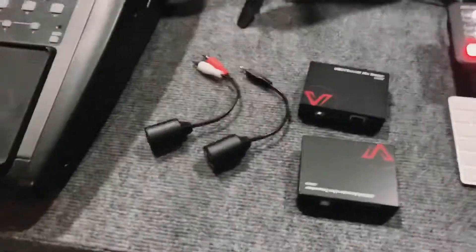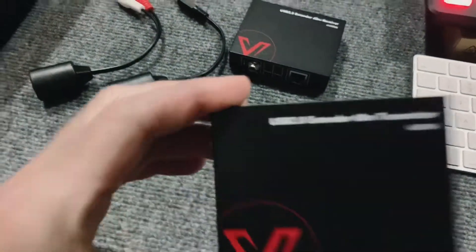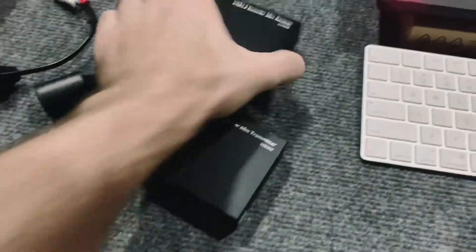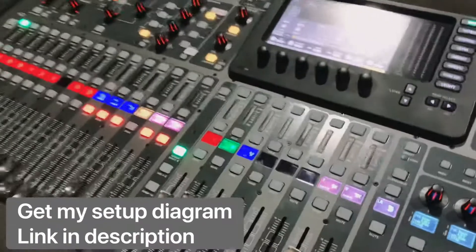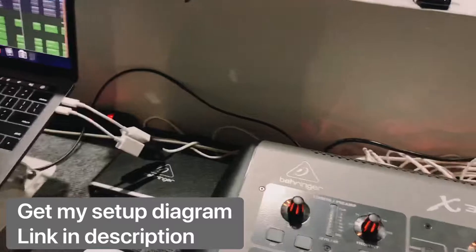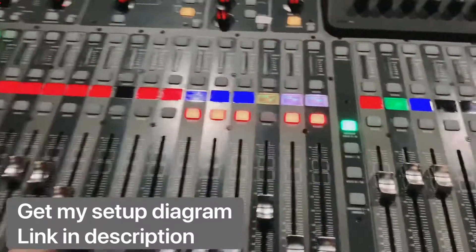The cables go up through there and out here, right into this room. Here are the adapters I'm going to use to make this happen. These adapters run Cat5 — I'll put the links in the description. This is an Amazon USB 2.0 extender transmitter: one side has USB and the other side has Cat5. Basically, the X32 is coming out USB into our computer — that's how we're interfacing — going out here into here, creating a sound card inside of Logic that sees all of our channels in the X32.